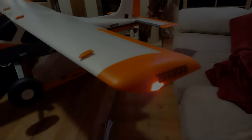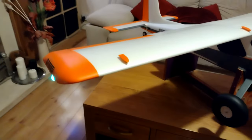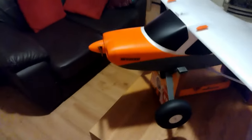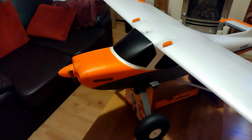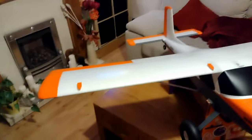And this is the final result. Red light on the left port side and green light on the starboard — that's looking nice. The difference I've made with the wiring is I've used a single 8-pin connector for the wings to fit on, so not only do I not have to deal with fiddly little Dupont type connectors, I don't have to worry about getting them the wrong way around.